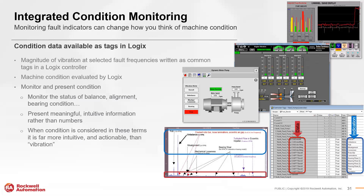The 1444 system's ability to seamlessly integrate and translate information into tags in a Logix controller is particularly valuable. Those tags display not just the amplitude of a vibration fault but are categorized and split up by frequency and frequency bands, giving insight into the specific attribute or component causing the vibration. During setup you can assign descriptions to each frequency band — such as 'bearing wear' or 'unbalance' — so that when you view tags or associate them in your visualization platform, the context is immediately clear.